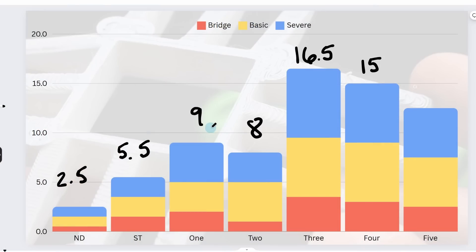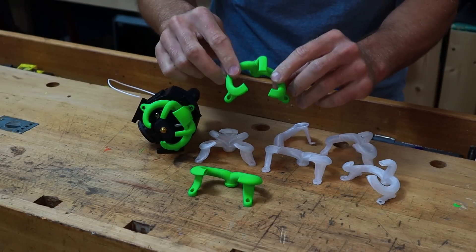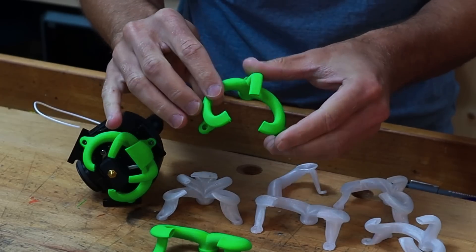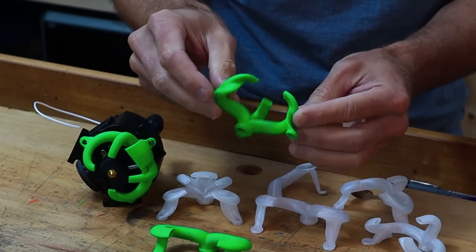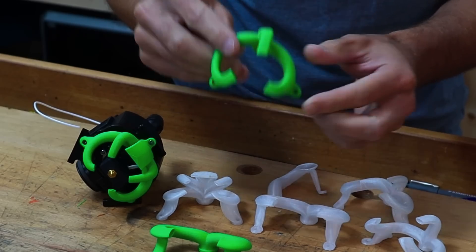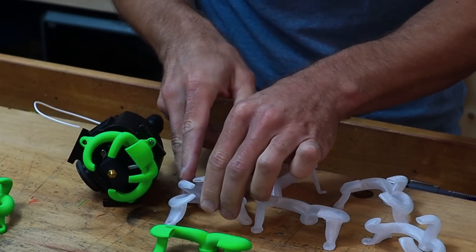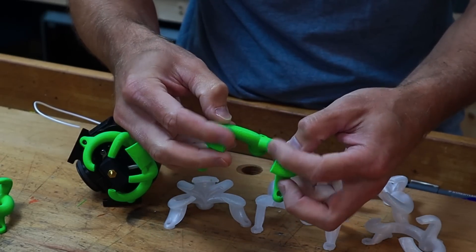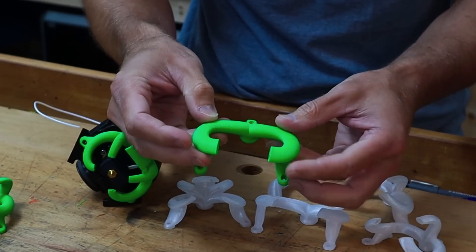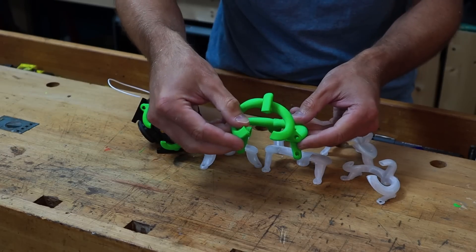In my testing, more does seem to be better, but at a certain point it's not necessarily better. This may also come down to the positioning of the airflow or the airstream. The three-duct version was offset to each side of the nozzle, creating a vortex effect, and it provided the best results. I'd also like to try this on four and five ducts in a future video. There's still hope for two ducts as well — offsetting those two ports slightly to each side of the nozzle would give warmed air a place to go and create a similar vortex effect.